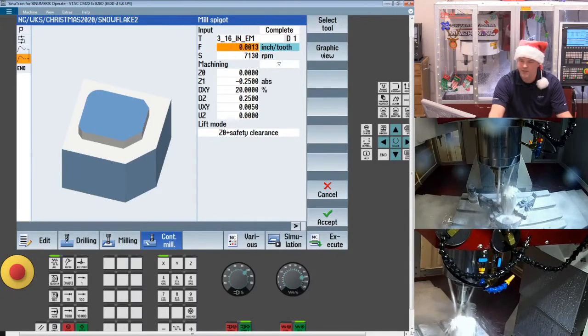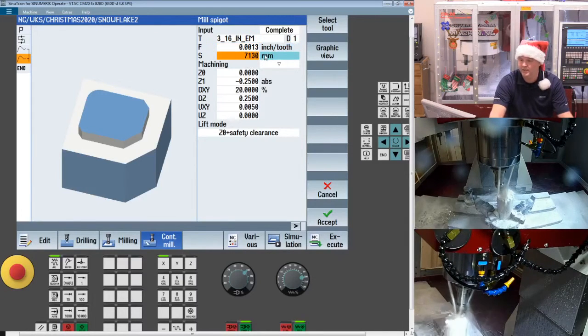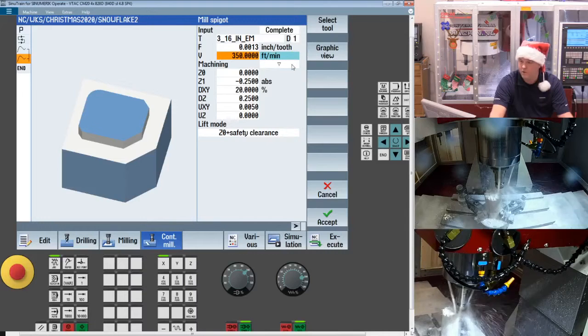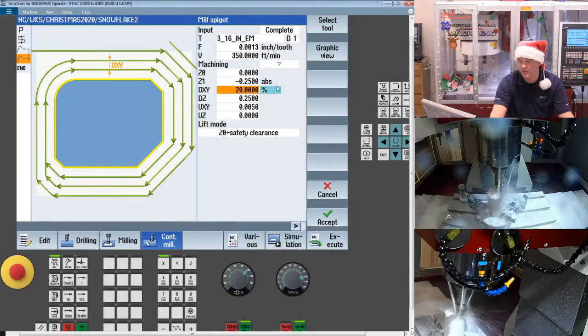So I want to be kind of cautious of my speeds and feeds here. Certainly in aluminum like we're running now, I'd rather be up in the 600 surface footage range if I had the RPM. So I'm just going to cut things back a little bit. We're going to rough it out. Top of the part, total depth. Radial step over engagement. This could be a linear distance or a percentage of the cutter. We're going to do a percentage of the cutter.